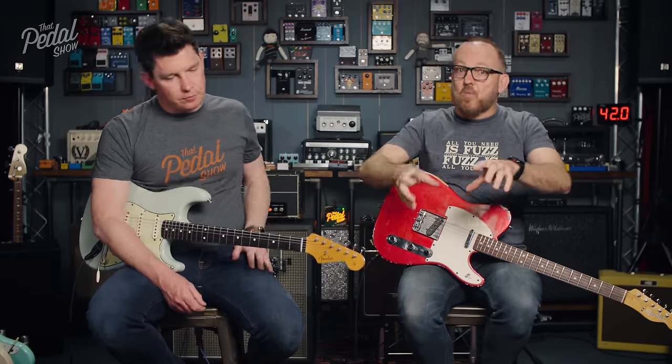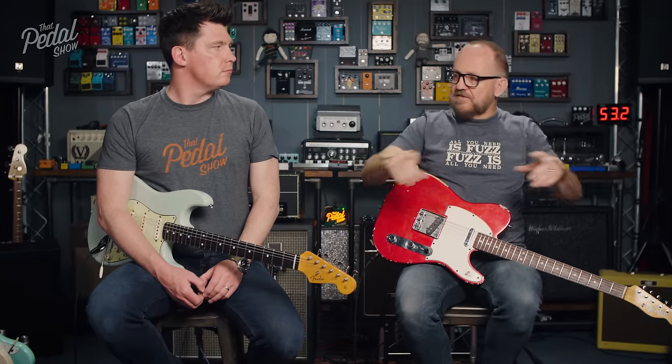A fairer example, because if you just unplug from the input of your board and go straight to your amp, people go, oh man, it sounds loads better. But it's also important that you also use the last cable, because you've got to take into account it's not just this cable. You've got two cables. It's a cable from the board. So just grab one true bypass pedal and plug both cables in, and then you're hearing the capacitance of just those cables and one switch. Then put it in your board, and then you'll hear what the board's doing. What you're losing. There you go. I'd say losing, because you might want to lose it. There you go. Yeah, absolutely.